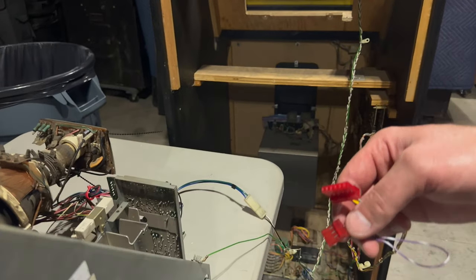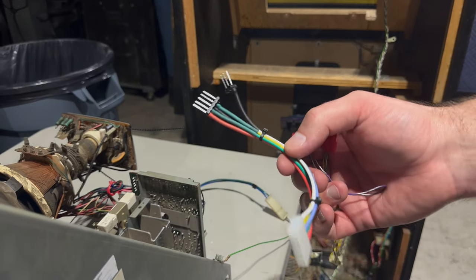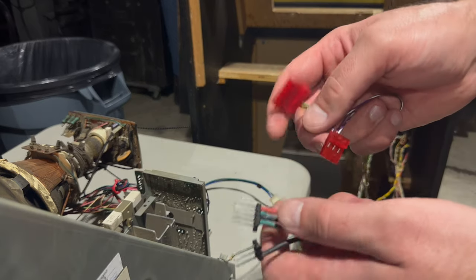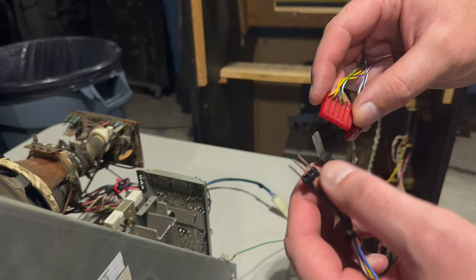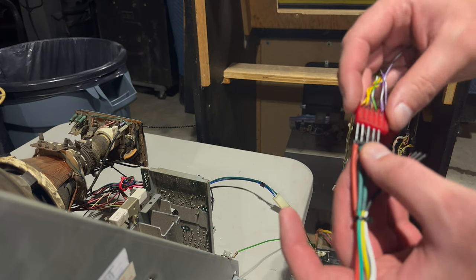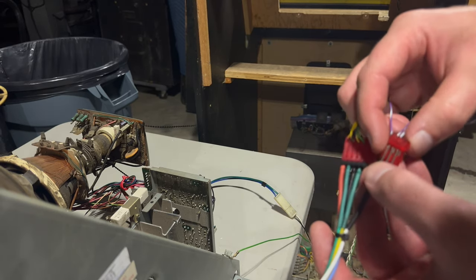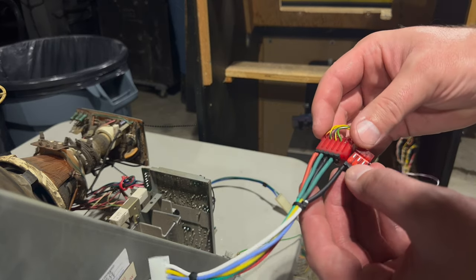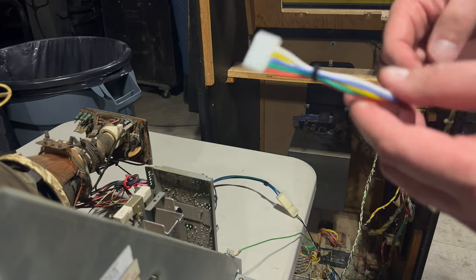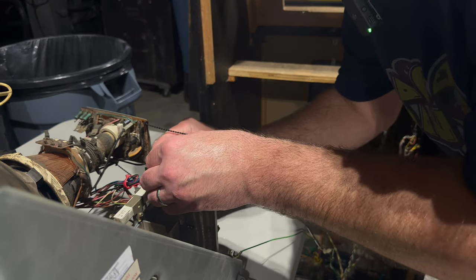So what I did, I made a little adapter, kind of a makeshift thing that I crafted, that will allow me to change the pinout. Sorry, it's kind of an awkward angle, I can line up my red to red. This is a blue wire and a green wire, red, green, blue, and then ground on that one. Over here we have the sync, and there's a single sync wire that goes in like this. So now we have the connector coming from the harness of the cabinet, and I'm just double checking my lineup here. Then we can plug that into the deflection board, the video input headers.